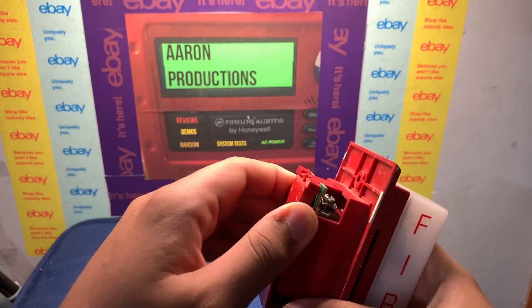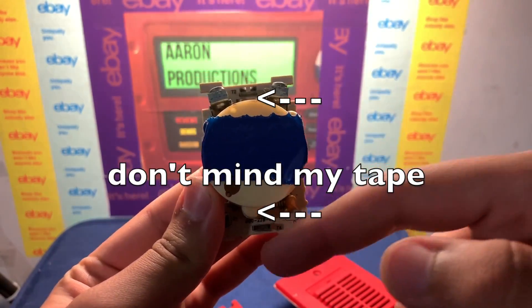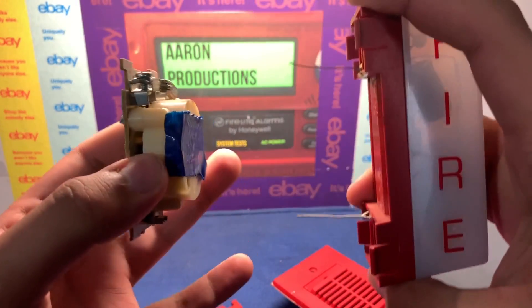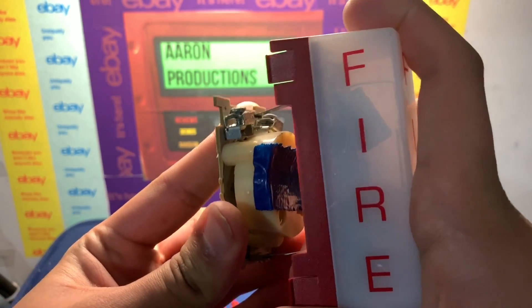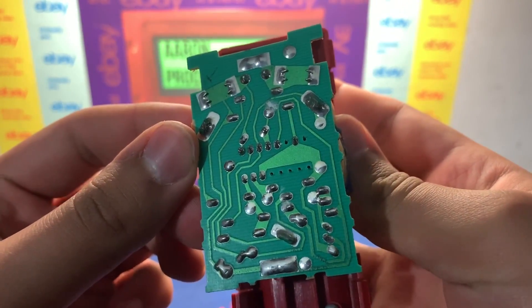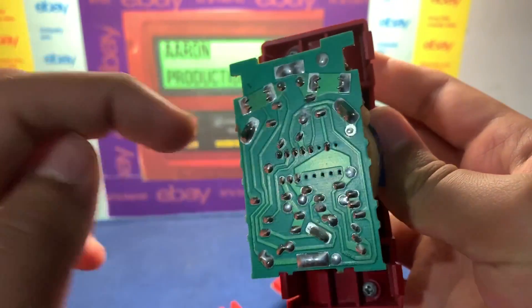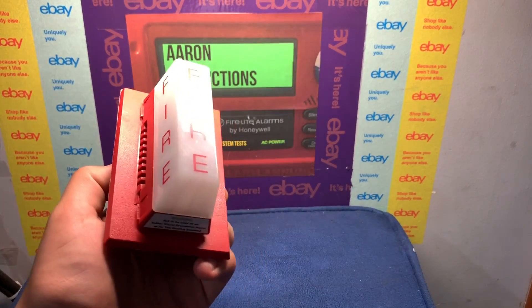You may look at this and say it's just some copper strips inside a piece of plastic — so how is this supposed to work? But taking this device apart, we can clearly see there are two connectors at the top and bottom for it to connect. With the device opened, you can see how this is inserted inside the hole and makes a tight connection to the back. This is how the power is supplied: positive goes straight here, negative goes through a couple of traces down to the bottom.